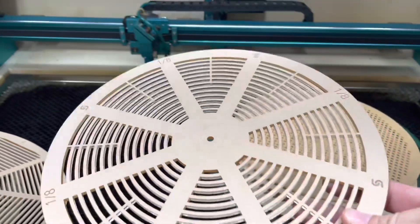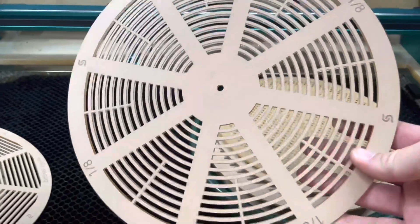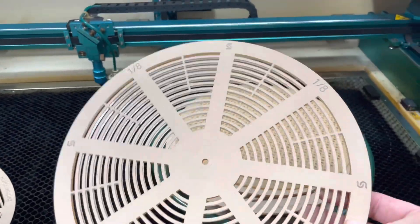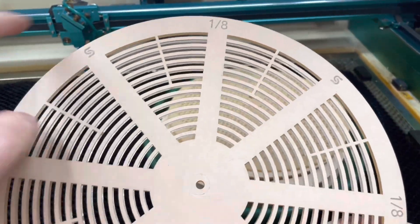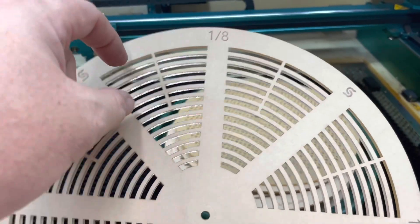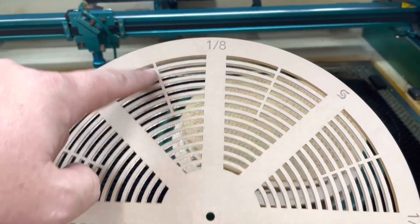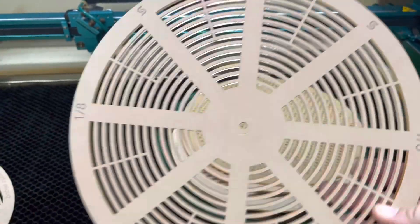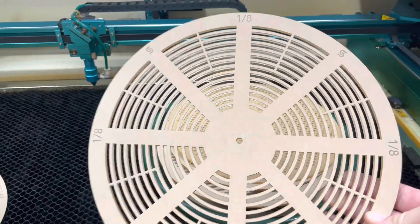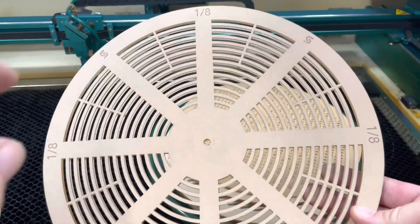Here's another one that never made it onto the store. This had a rounded slot design — I think it's my favorite, prettiest I guess. But when I sent it to a customer to test it, it was so long that it started to bend and it wasn't consistent. So then I had to add an extra rod here. I still like it, it's just a lot and it's kind of ugly, but I had the right idea — I don't need such thick supports either.